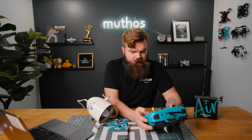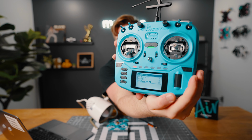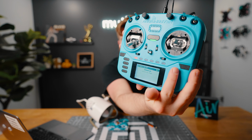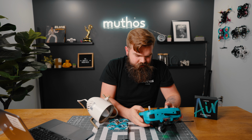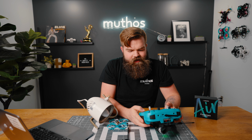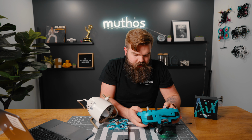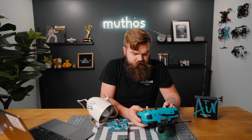Okay, so now we are bound to the controller. What I will do though is whenever I go to the TBS Agent Lite, I'll wait until the Nano RX V3 shows up. You can't really see that. Yeah, you can see it. Nano RX V3. I'll click that and then I'll go in and change the amount of channels I can have. It's automatically on 8 channels. I like mine to have 12 channels. And then you can change your failsafe and all of that stuff, but everything else is normally fine.